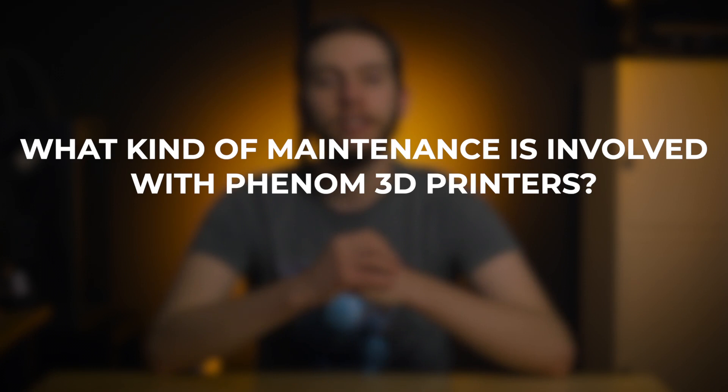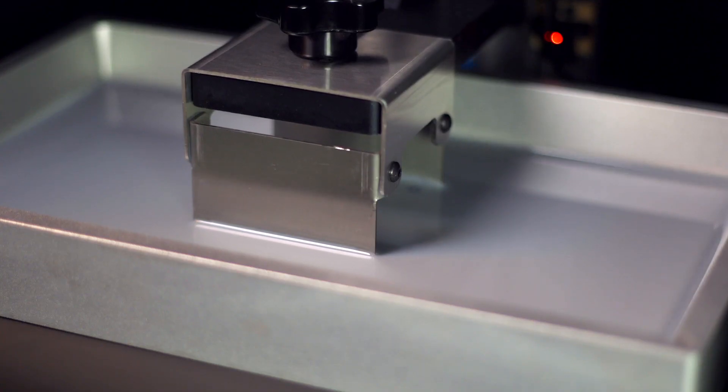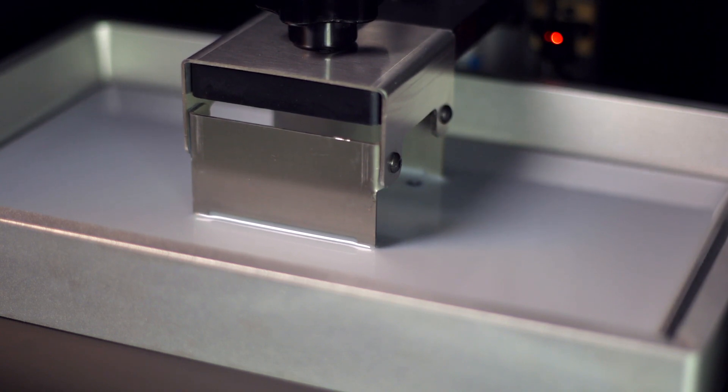There isn't a lot of active time and labor involved in cleaning a resin 3D print, as most of the post-processing is sitting in a machine and waiting for it to finish. Like any type of machine or tool, you'll want to keep your Phenom clean and tidy — wipe down the chamber with isopropyl alcohol and paper towels to prevent any sticky buildup of resin, and just stay on top of cleaning your work area. The LCD panel is considered consumable, so you may begin to notice dead pixels in your 3D prints, holes, or uneven curing when it's nearing the end of its life, at which point you will want to replace it. Each Phenom printer's LCD has different lengths of life, so you'll have to pay attention to your printing results and identify the degradation to know it's time to swap to a new one. Desktop large format resin 3D printing is a new and exciting prospect that continues to grow and find its place in the 3D printing industry, with the Phenom leading the charge.